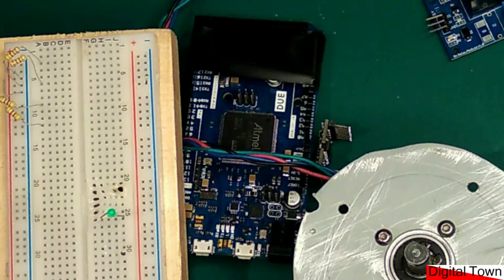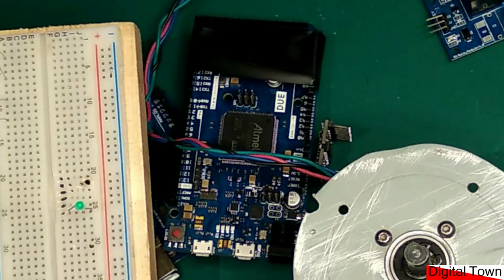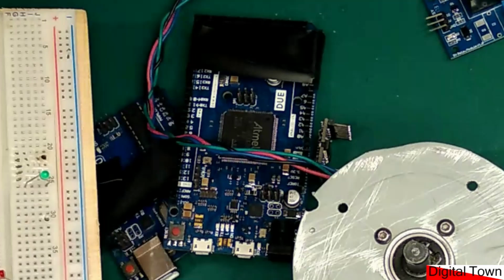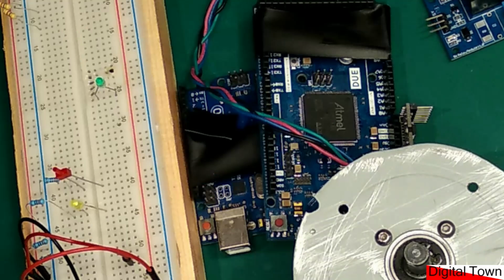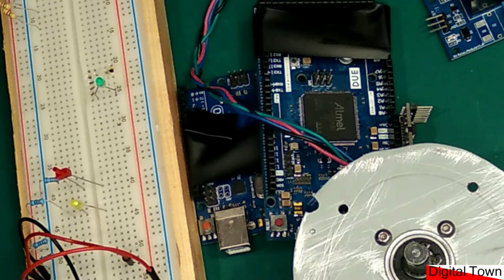So just think about voltages, especially in your finished project. If you're using a power supply, where is that power supply coming from? Can it short out? Can cables get pulled out? So that's the first thing we're going to think about with our projects. Do they fail safe electrically?